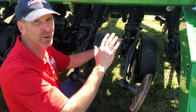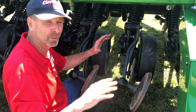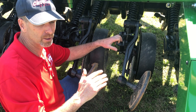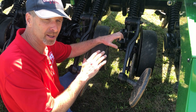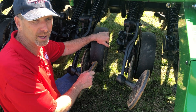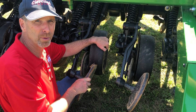If you're running that gauge up in the red zone and you're starting to see the left-hand wheel on the drill lifting off the ground a little bit, you're starting to lose depth control. Back that pressure off so the whole drill stays firmly planted on the ground. One way to check: have the operator run 15 or 20 feet through the field on a fairly level spot and stop without letting the drill coast backward. Then walk along with the drill on the ground and make sure the depth gauge wheels are all firm on the ground. If 90% of them can't be turned by hand or kicked with your boot, you've got plenty of down pressure. If some still spin freely, consider adding a little more down pressure.